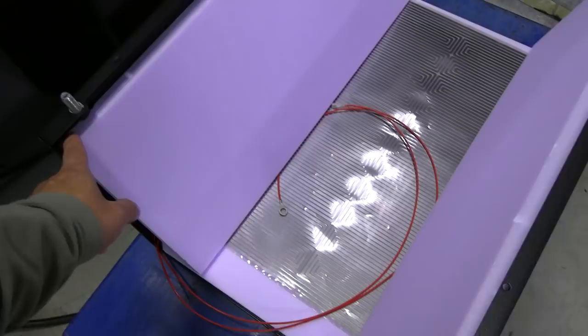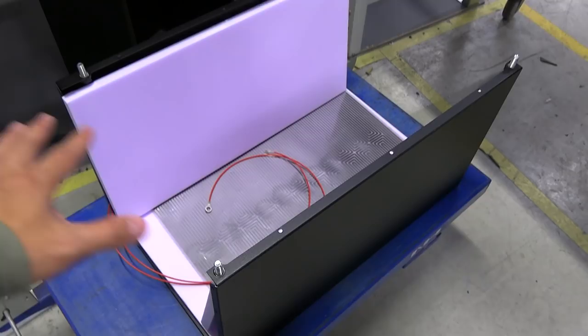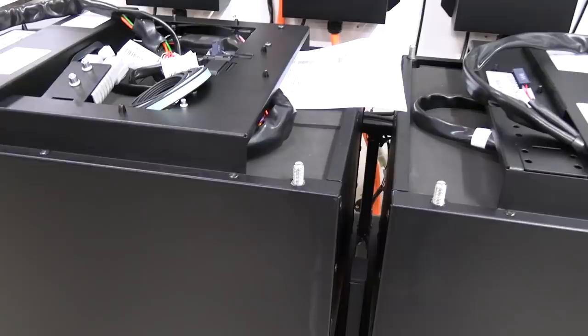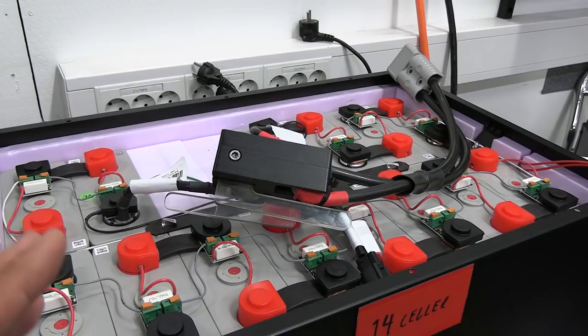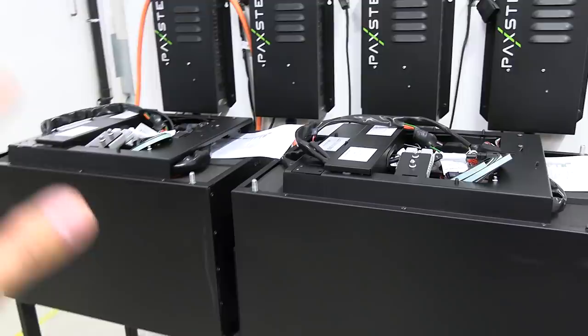There's also styrofoam insulation on the sides, bottom, and top — it's actually heat insulated. There's no overheating because the power output and charging rate are so low, so no active cooling is needed. In winter, the battery will stay at 10 degrees Celsius and above, which is very nice for the battery — it works great even in Norway. The pack is assembled and then balanced here.